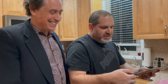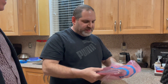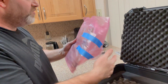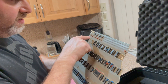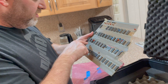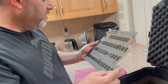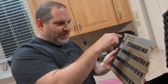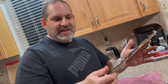It might be the only one not in his possession. I guess I'm not restoring this one. I'll write something up for it — we can do a condition report, to show the style and that it was hand-soldered. The other interesting part is he populated this section here, even though he wasn't using it, because it probably wasn't set up for the 6501 — it was set up for the 6502. But he populated this section probably to test that the clock was proper. This circuit worked because they were shipping it where it could be 6502 or 6501. Before they thought they could sell them complete, he was definitely selling partials.